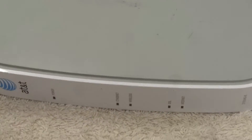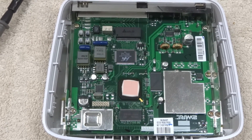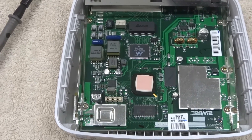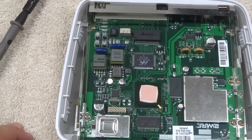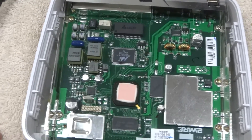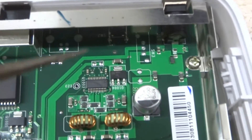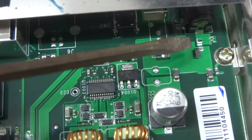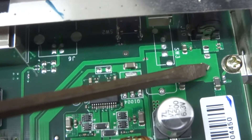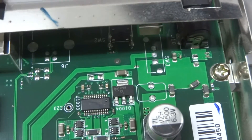The problem should be in here somewhere, so let's go ahead and open that up. This is what the inside of the router looks like. There's no obvious problems — all the capacitors check out fine, and you don't see anything that's particularly blown or damaged. So I started probing around checking voltages, and back here is where the power plug is. Something interesting happened: this little surface mount resistor right here just popped off the board just from probing it.